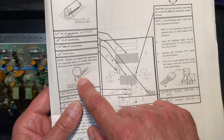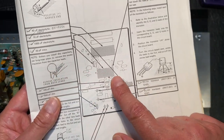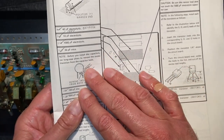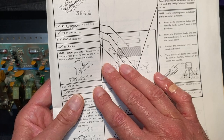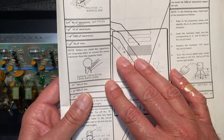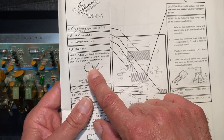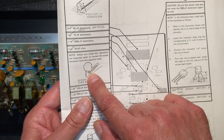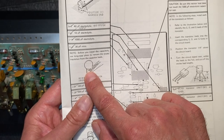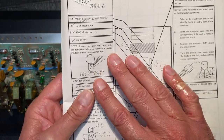And by removing that little bit of excess epoxy, you sometimes can get the capacitor to sit more flush with the board. And perhaps with something like an oscilloscope, keeping that stray capacitance under control is important. But personally, I don't think that tiny benefit you may or may not even see is outweighed by the fact that you could damage the leads of this capacitor by breaking the seal. By breaking off this epoxy, you could be allowing ingress of moisture to get into the capacitor and do more damage over time. So again, in general, I don't recommend doing this.